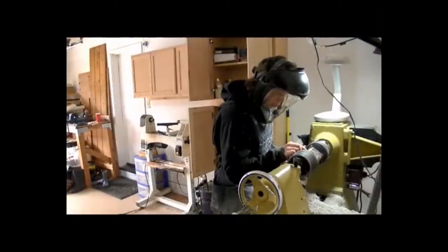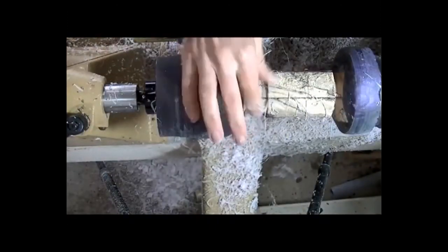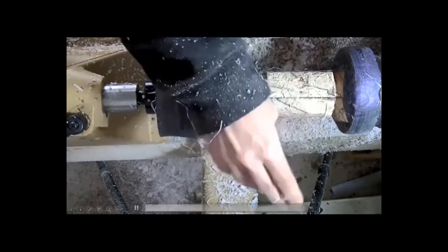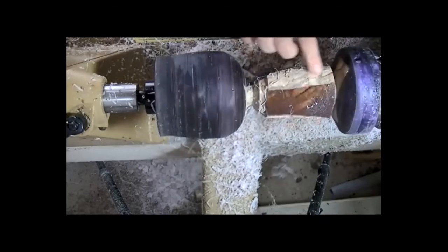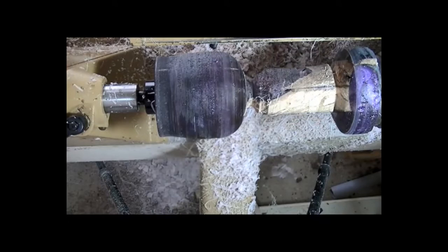That wood does not look like it got penetrated by the resin. Still feels a little bit punky to me. So that'll serve well when I put resin on top of it; it will be protected and be nice. But right here is going to require quite a bit of sanding. You see right there a little pocket formed, which is fine because I'm going to be turning it down more anyway, but that's what you hear sometimes, it chipping away.